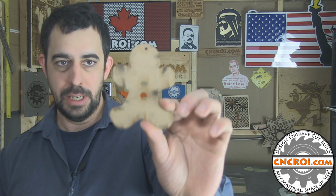When it comes to making custom jigs, what you generally want to have is roughly 1 millimeter or 1/16th of an inch of play with the part. When I first started my company, we made our jigs so everything's totally perfect. And the issue is that sometimes you put a piece into the jig and it takes longer to put the piece in or take the piece out than anything else.